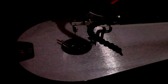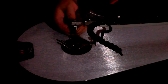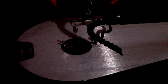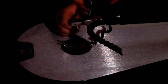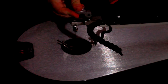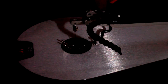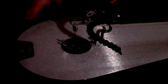This has almost all the features I really want, except for that one thing. Everything's up front — the variable speed control, the tensions are fairly easy, I can easily switch the blades, and I can also take the blade off toollessly. I need practice — I haven't quite figured out how to get it all working correctly and get my hand in here, which actually is something I should have tested because I have fat hands. I think everything on here is cast aluminum. Porter Cable doesn't cheap out on stuff to that effect. It's got a nylon washer on there, everything seems to be quite sturdy and well made.